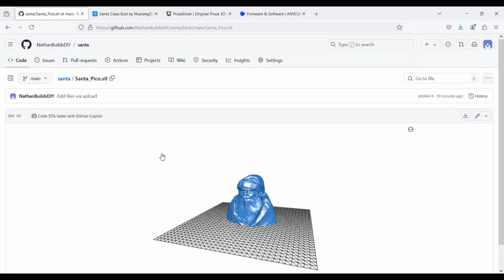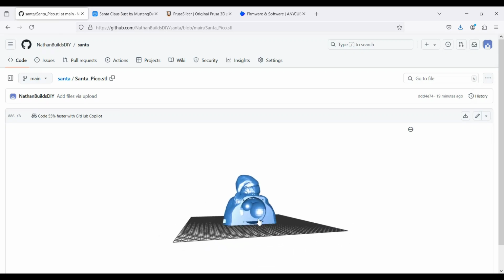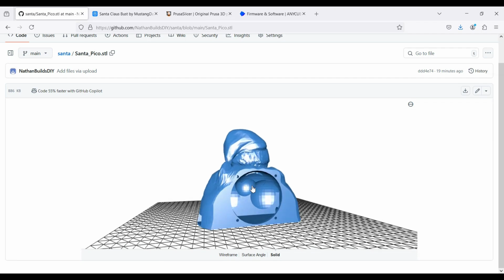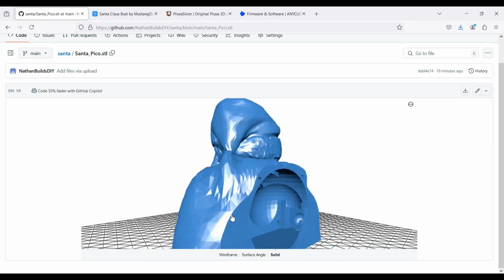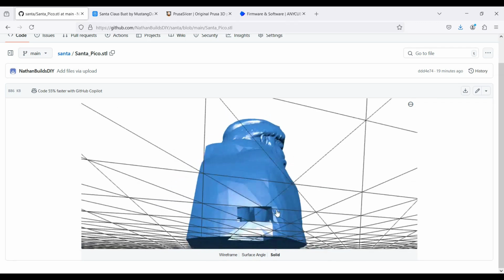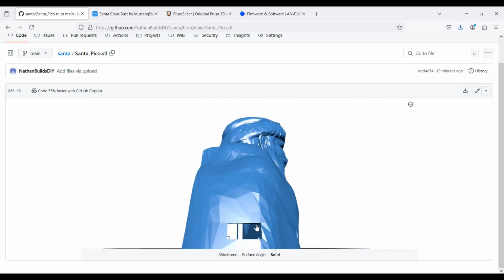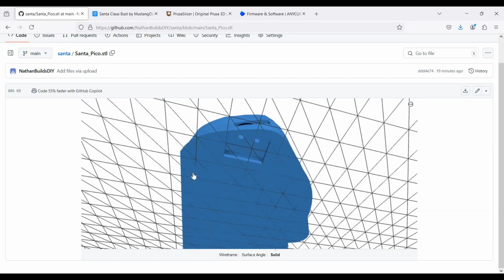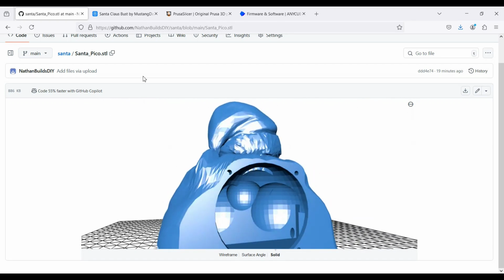What I had to do is make it a little bit bigger and then hollow out the back side, to keep it printable. I don't want to need supports or anything like that, but I hollowed it out so we could fill in our electronics, fit in a USB there, and then over on this side we can put our contact so that we can connect to this, and down below we've actually got a couple holes so that we can hold that contact in place without it moving. So it's just a slightly modified version of that.